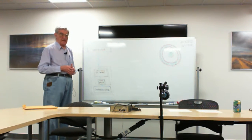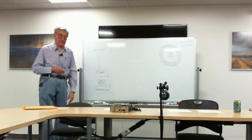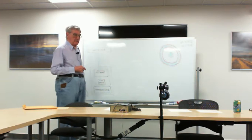However, if you have either a short circuit or an open circuit up here, by just throwing the antenna away, all of the energy is reflected, and you end up with a standing wave ratio of infinity. Not good for your transmitter at all. It'll cook it every time, unless it has protective circuitry that can react very, very quickly. There's a few really good transceivers that will do that. It's just possible that my K3 will do it, but I'm not going to try to find out because the consequences are just not good.